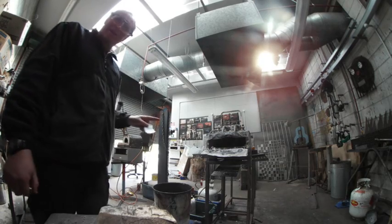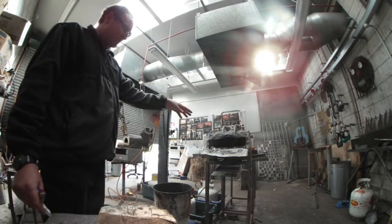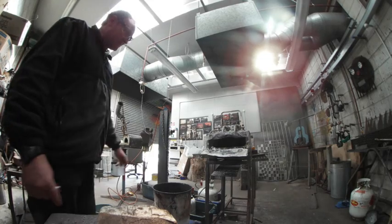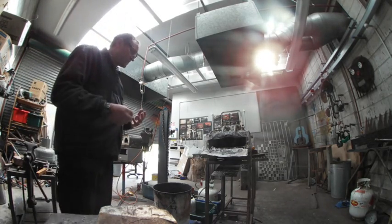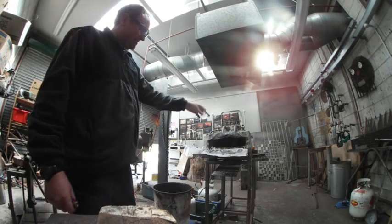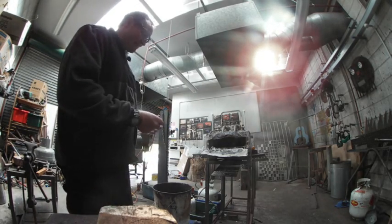This is where the gear you have can influence how you do things. I tried to use my digital thermometer to regulate this to around about 850 degrees Celsius — I believe that's the temperature I should be going for for normalizing. But I can't stop the gas getting in there too much, so it pops straight up to a thousand degrees really easily.